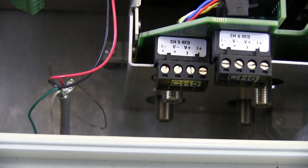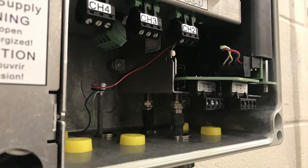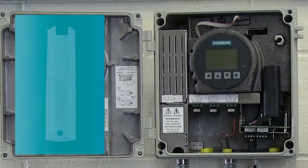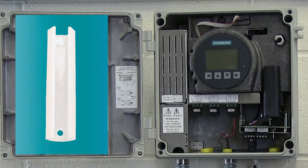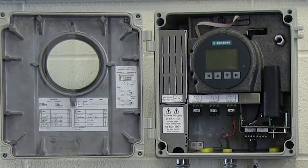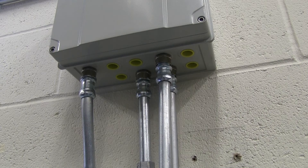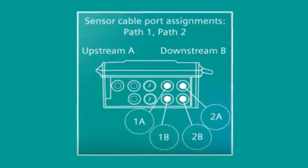The flow sensor cables require a different installation process than was used previously. This is because the FS-230 flow sensor cables connect to F connectors that are recessed inside the enclosure to meet electrical isolation requirements. Connection of the sensor cables to the internal DSL requires the use of the provided F connector tool. The connections must be made prior to securing the conduit to the FS-230 case. You can use flex or rigid conduit by observing just a few simple steps. For illustration, we'll use rigid conduit. Note that the two openings on the left are for path 1 and the two on the right are for path 2.